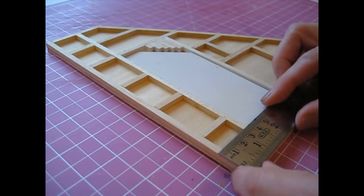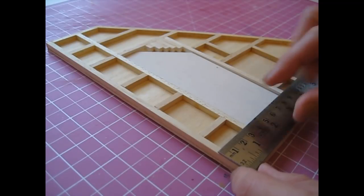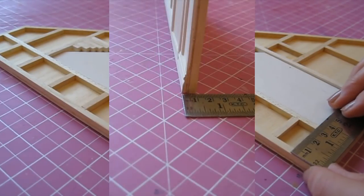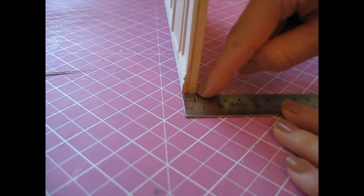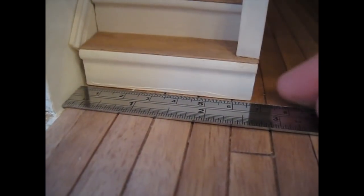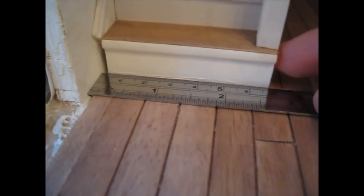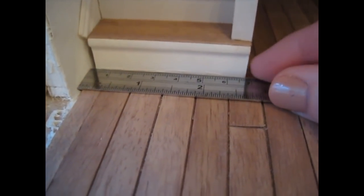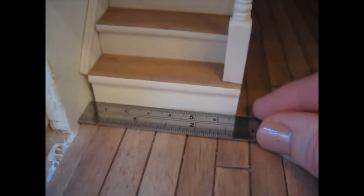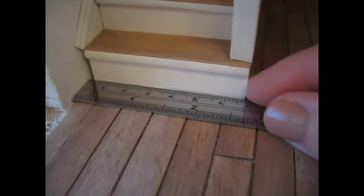For the depth I'm going to measure this area here — from the wall to where the door begins is 35, but I'm going to make it 33 just to give a little bit of give so it's not too tight. For the width of the shelf unit I'm going to deduct the width of the wall, which is 10 millimetres, from the width of the stairs — measuring from the wall to the edge of the stairs, which is 68 millimetres. Minus that 10 is 58, so I'll make it 55 millimetres wide, giving three millimetres of give.